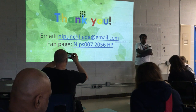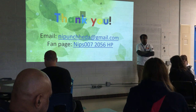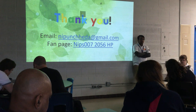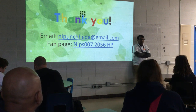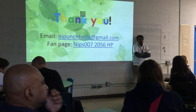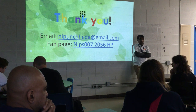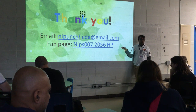Post-presentation: You were saying that soldering presents challenges since we're using lead-free solder. Lead-free solder flux will help a great deal. Make sure you properly tin the tip, and if you're using an old lead-soldering gun, it's a good idea to change the tip to avoid contamination. Also, Automation Direct is another source for ferrule crimpers, and you can use part of your credit on a first purchase if you want to buy that tool.